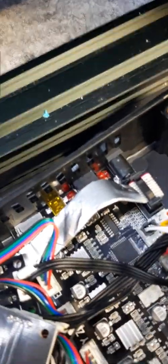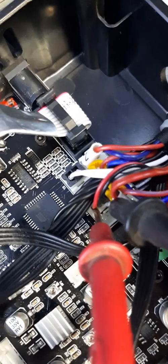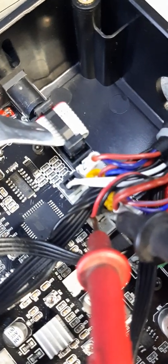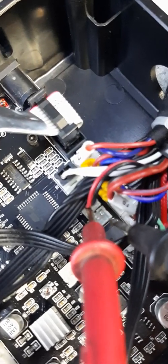To check whether it was the fan that failed or the wiring, I used my multimeter, back-probing in parallel with the wires — being careful not to touch the board, touch them together, or touch the other fan's connections. You have to hold them in place and then switch it on.